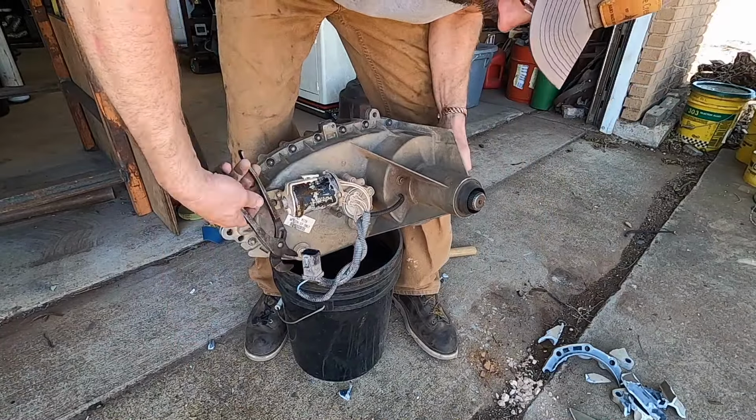And so, my plan was to melt down pieces of the body of this torque converter transmission deal and cast a handle around the tang of our blade. That's not gonna be possible because you need an inert atmosphere to melt and cast magnesium, because if it comes in contact with oxygen, obviously, it's gonna combust. And so this little bitty piece of magnesium, that's probably too big actually, that I just knocked off with the hammer during the demo there. Let's make that smaller.